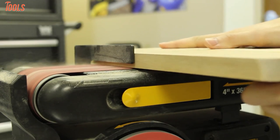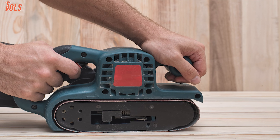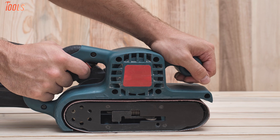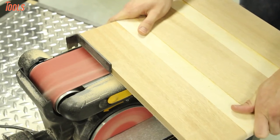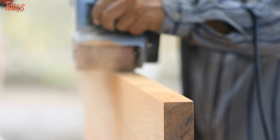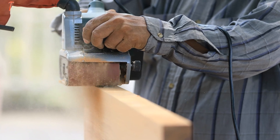It's essential to sand with a wood grain line rather than going across it. The capacity of the sander is measured in feet per minute — how much distance the belt covers with the spin of the motor. The belt sander is needed for shaping and finishing larger wood and other materials, but it requires well-experienced hands because it can grab and damage the wood rapidly.